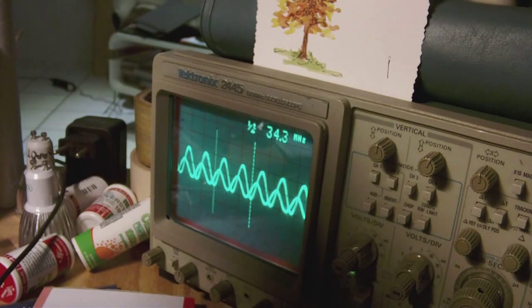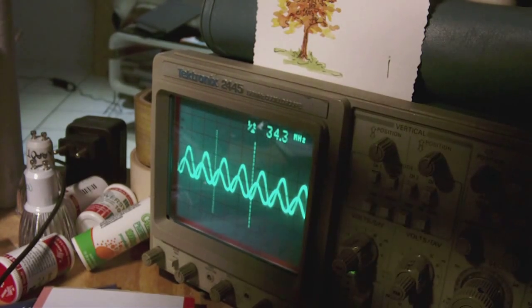Apparently the attenuator, which you'll remember is a slidable, adjustable capacitor, shifts the attenuated signal by about 45 degrees compared to the unattenuated one. Still, the frequency is the same, so whether one or the other is shifted in frequency, I mean in phase, doesn't really matter. The phase shift has absolutely no consequence on using it with any other kind of circuitry.